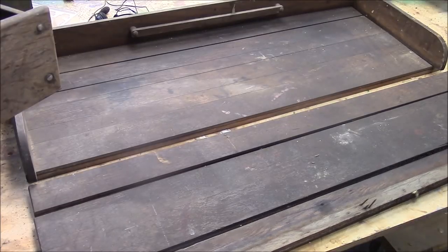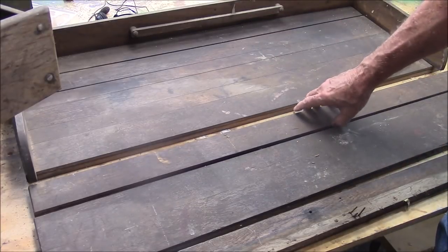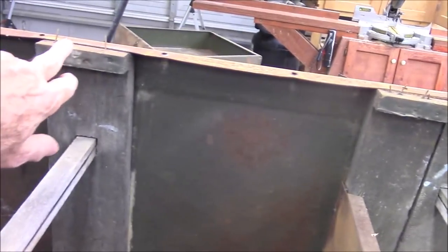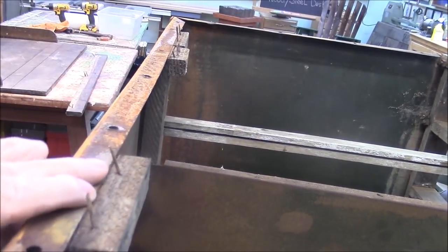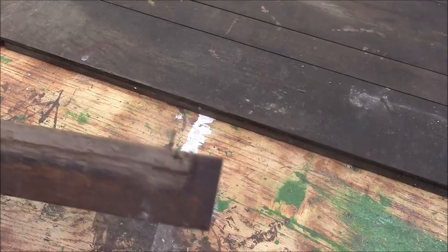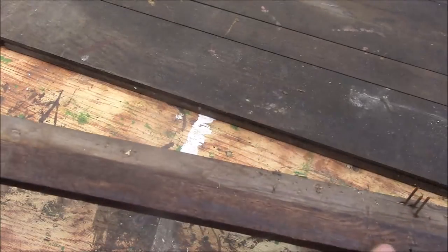I think one of our technical challenges is going to be restoring this oak desktop. It's been soaked — looks like it's been soaked in oil. Over the years, as the top failed, they went to extremes. They put these blocks in here and then drove nails. Here you see some of those nails coming through. They put this block in here and tried to attach the top with the nails. So our top has nails all in it and some of them are broken out. What I need to do is take all these nails out.